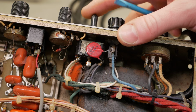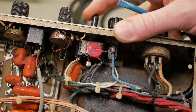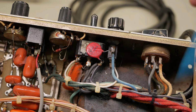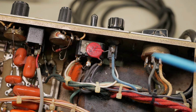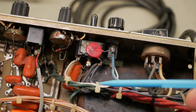In this one, they've got a polarized plug, but they've got a switch to switch between your two lines. Now, this is completely redundant when you've got a polarized plug and a ground pin, a three-pin plug. Completely useless. I don't know why they installed it on this one. Maybe this was meant for the US or the international market, and maybe they had a different transformer in there, I don't know. Makes no sense to have it.